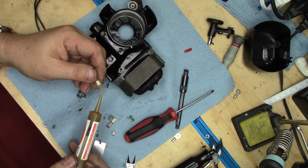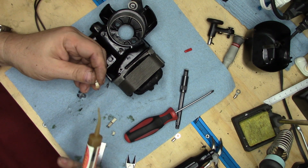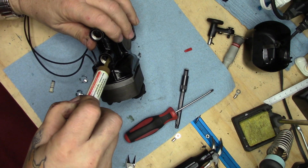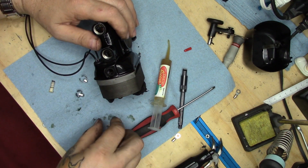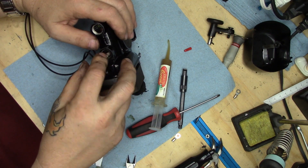I put a little bit of Sole Retro grease — which I get from the Featherweight Shop — on the end and down in the hole right on the shaft where the wicks go. So I preload just the area of the shaft and then stick a wick in the hole.